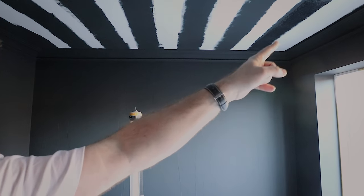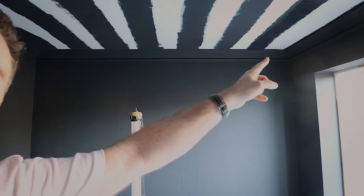Now, seeing as I'm doing a ceiling, I've got to treat it like a wall and think which way would be left to right. So my first length will be hung just there, and that's actually, let's call it, the top left corner. Now, I've said I've allowed plenty of paper salvage off cut, so clearly that would be coming off, it's just so I know where we are. I'm going to allow 2 inches waste before I put it into the actual edge of the coving.